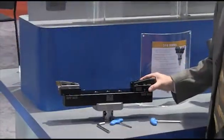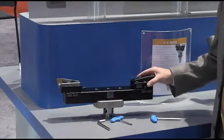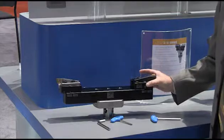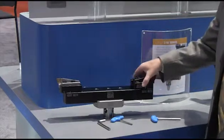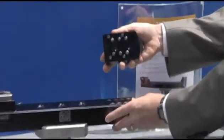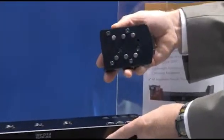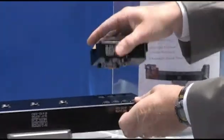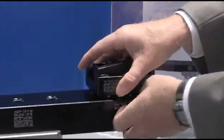We are calling this the new 318 program. The tools, instead of being put on from the side as before with our competitors and our 317 tools, are now assembled from the top and held in place by high precision, high strength pins. These pins locate into precision bores and can only be placed in two positions.